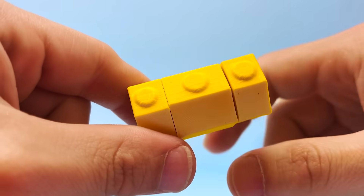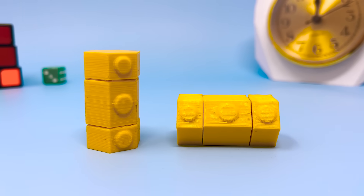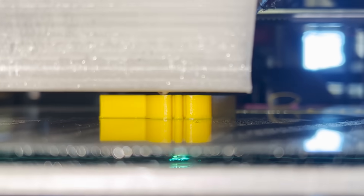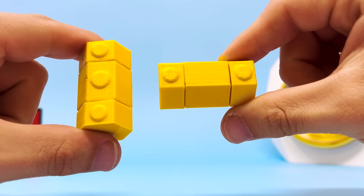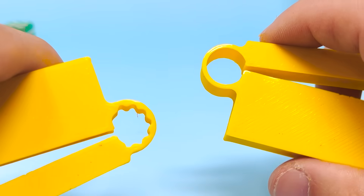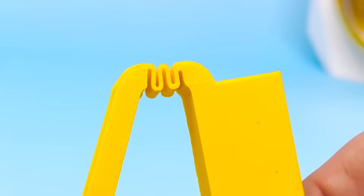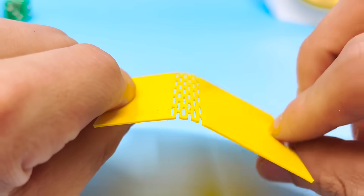This is generally for cheaper applications. If you have a large hinge door, you have so much leverage that it would never stick or have an issue, but it just isn't as smooth as the vertically printed option. So there you have it — there are all kinds of hinges that can be made, and with 3D printing you can make impossible hinges that are not possible any other way. Depending on your application, use the best hinge that works for you based on the profile, your requirements, and your cost. Just make sure that you're designing for the process.